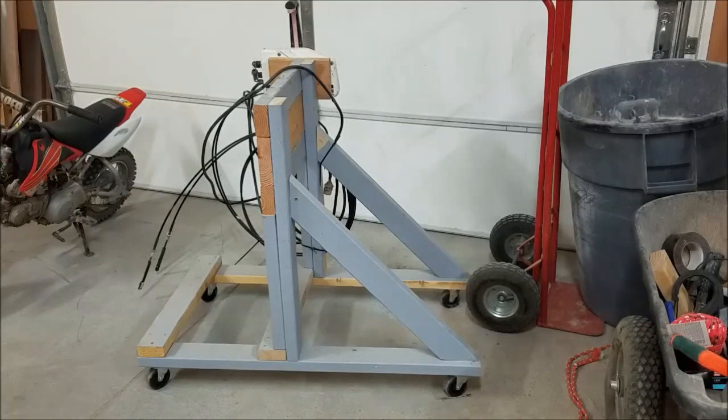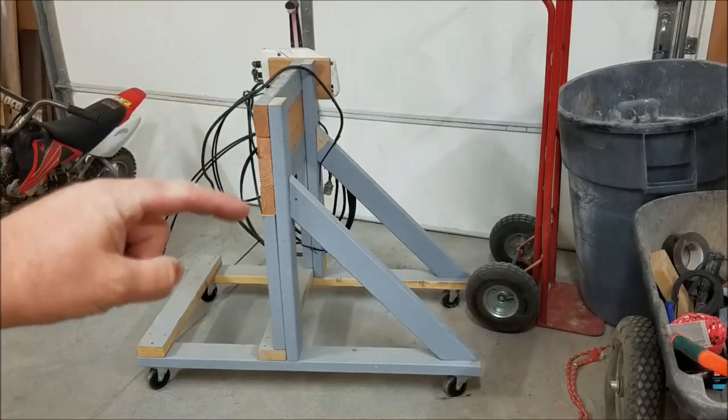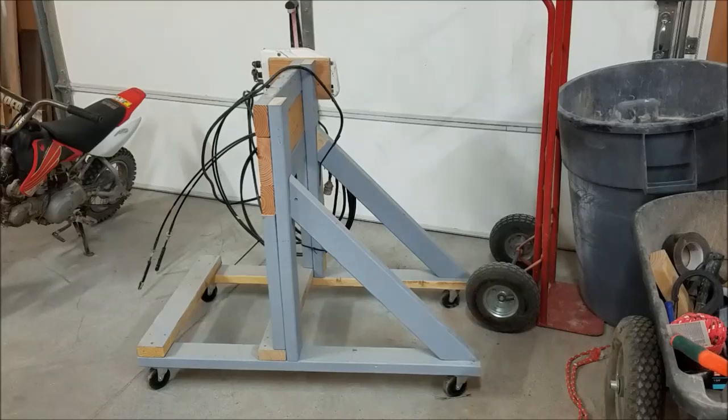However, they aren't cheap to make. If you're not using recycled lumber, this one was recycled lumber from some plaything we made for the baby. Anyway, you need like 6 2x4s and preferably a 2x6 for the top here. You also need a bucket of screws, and then you're gonna need casters as well. What I do to get casters is go to Harbor Freight when they're having a sale on their furniture dollies. I buy the furniture dolly and take the casters off, because that way it's 10 bucks instead of like 7 bucks for each caster. It's a pretty good little hack there, actually.